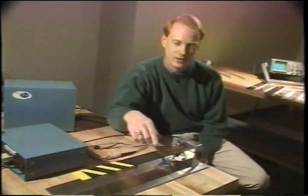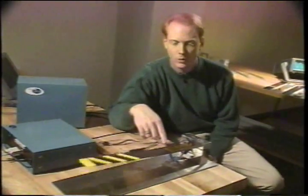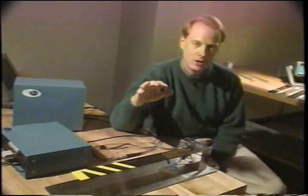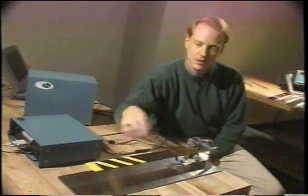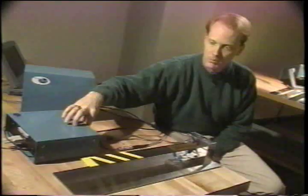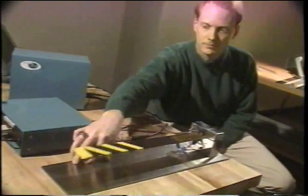Here I have one of our QuickPak devices attached to this steel beam. I can show you how I can make the steel beam vibrate with this QuickPak device. I can also design active vibration suppression systems where we can sense the motion in a structure and use these devices to induce an anti-motion to cancel it out. This is the beam as it wants to vibrate naturally. And if I turn on the damping, it stops it dead. Here it is off — and now it's on.